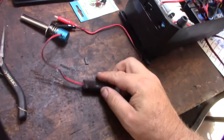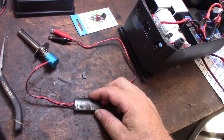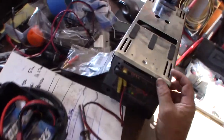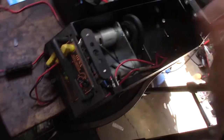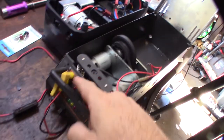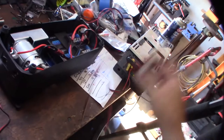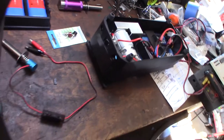So you need a way to reduce the voltage down — I think this thing handles from about 8 to 36 volts. We'll test it with my power supply here. But this Asuna one actually has the circuitry behind it that does the exact same thing — there's a PCB or circuit board in there with a voltage regulator. It takes whatever output the battery is and steps it down to 1.2 volts. So if you saw this one on Amazon and were thinking about doing this, make sure you get the one with the voltage regulator, because they sell a couple different kinds. Without it, it will burn out your glow plug.